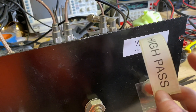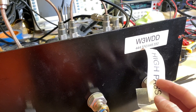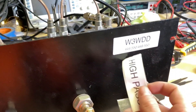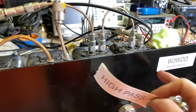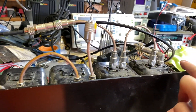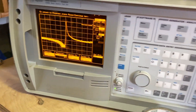A lot of people get confused about this — even on repeaters I've programmed. They'll give me these frequencies even though I try to explain that the repeater side is going to be the opposite of what you're connecting to. Your HT or mobile programmed to use this repeater is actually going to receive on 444.550 and transmit on 449. In other words, the radio is transmitting at 449 coming in here, and we're letting through 449 going to the repeater RX. It helps to draw it out — just remember: I have a repeater, a transmit wire, and a receive wire. Write down the frequencies from the repeater's perspective.